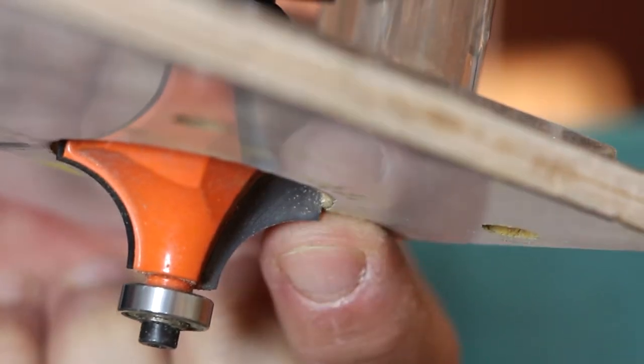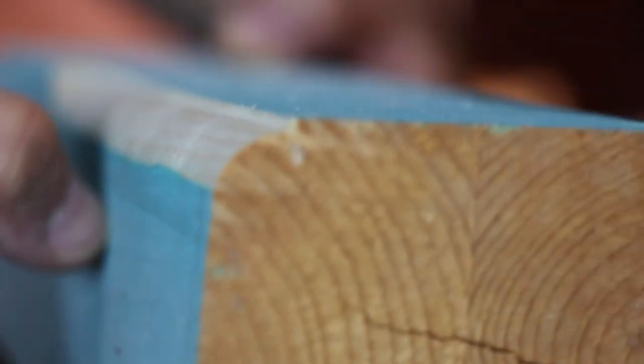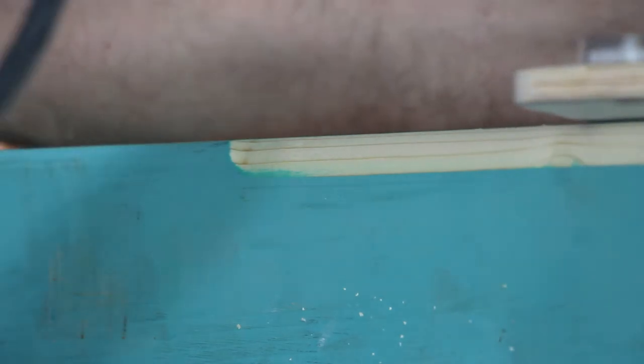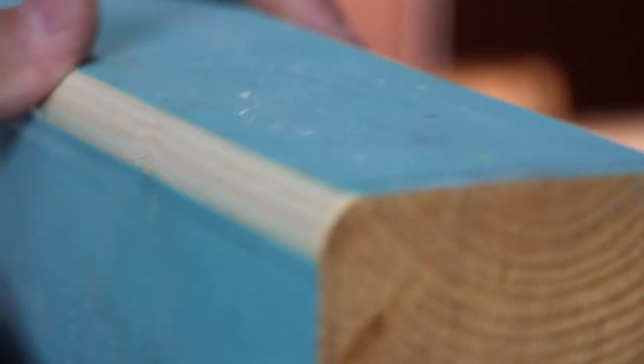The second thing to look for is that the other side of the blade is flush with the base or the table plane, if that's how you're using it. If the bit is protruding too much, the edge of the blade will create a step before the rounding. This can be a decorative addition when done on purpose, but is usually not what you're looking for — and it can be fixed with sanding, though the result will not give the radius you want since you've routed too much material. If, on the other hand, the bit is too deep in the base, you'll get an uneven radius which will have a sharper angle at the top. Since not enough material was shaved, the base can be adjusted and a second pass will remedy the problem. It is a good habit to always check that the blade is properly mounted on a scrap piece of wood.